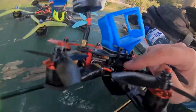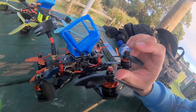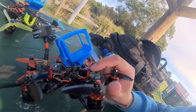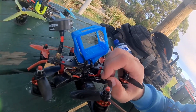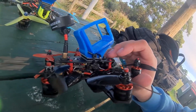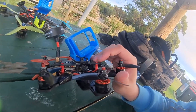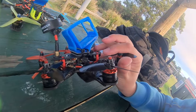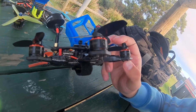It's got an XM Plus receiver in here which I really like. I don't actually run a Taranis — I run a TBS Tango with an XJT module, so I still use FrSky protocol. However I don't have as much telemetry available as a regular Taranis user. The way I get around that is by use of OSD, and in essence the end result is a display on the controller that is very much like telemetry — you've got your voltage, your amperage and so on. The only thing really lacking is audio alerts, but I respond more to visual cues anyway.